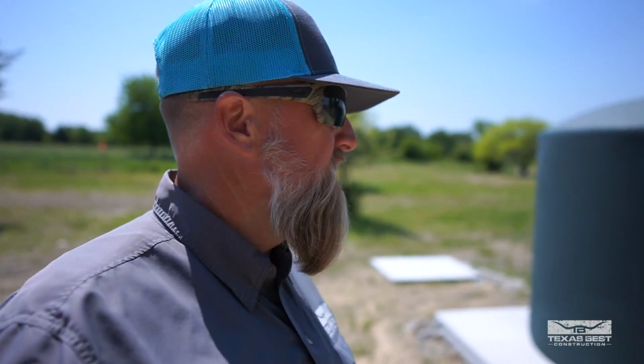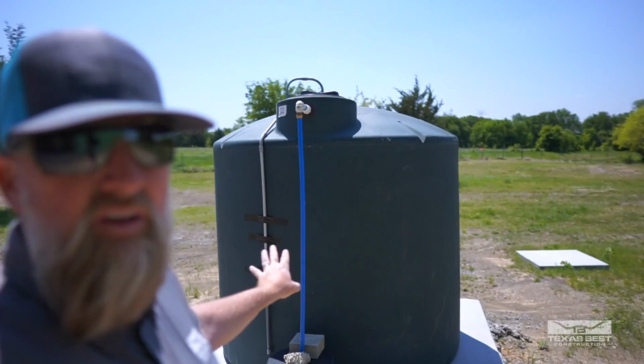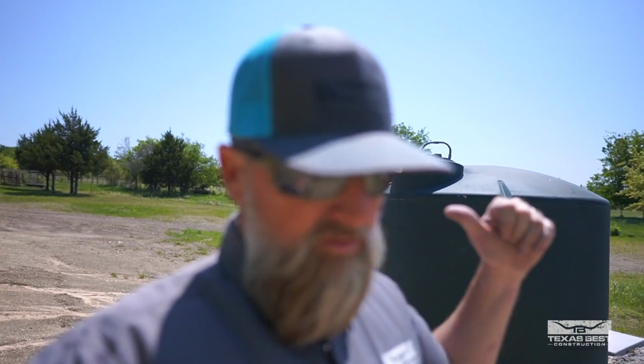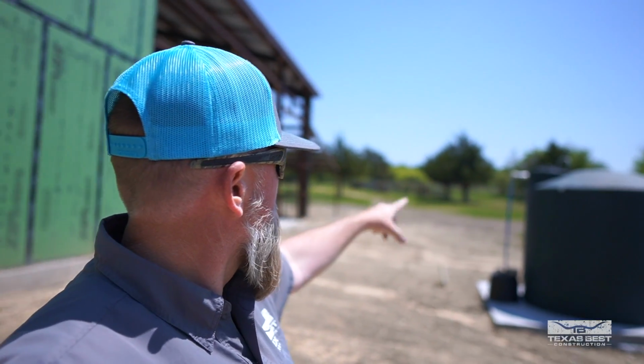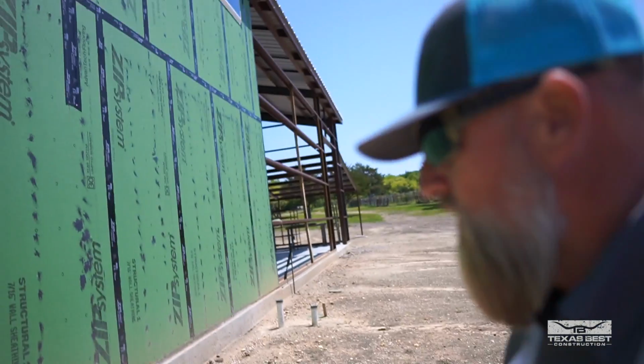Another thing we're doing here is our client has an auxiliary water supply tank. I talked about this in a previous video, but this will basically supply the house. They're feeding all the water off of a smaller line. So in order to make sure they don't have any pressure loss, they're actually storing water here, and they may even bring in fresh water.